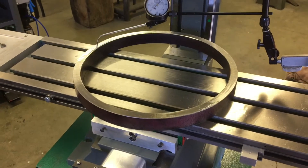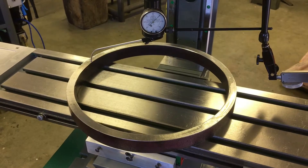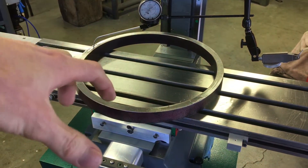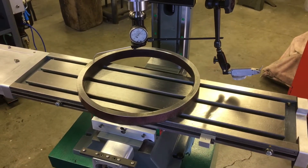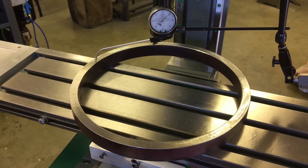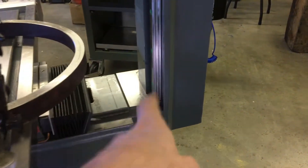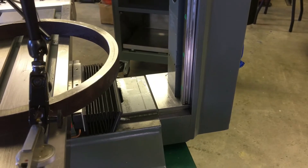This right here is a 12-inch ring — homemade, though you can get them commercially. They're often called an 'Easy Tram' or something; sometimes they have legs so you can set it over your vise to do one setup. Anyway, it's a 12-inch Blanchard-ground ring.